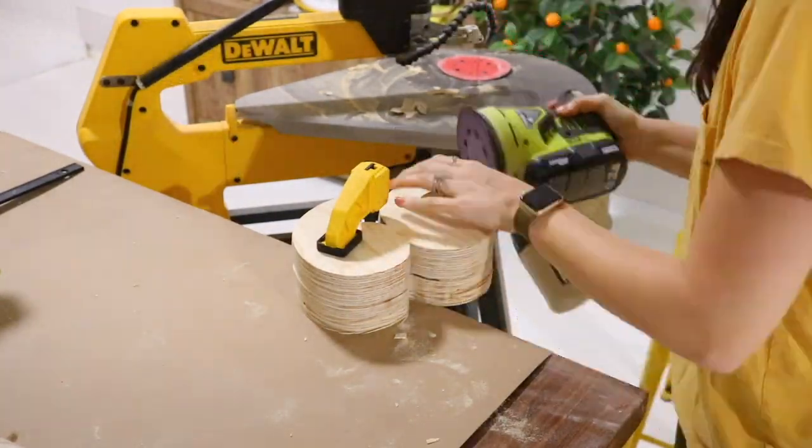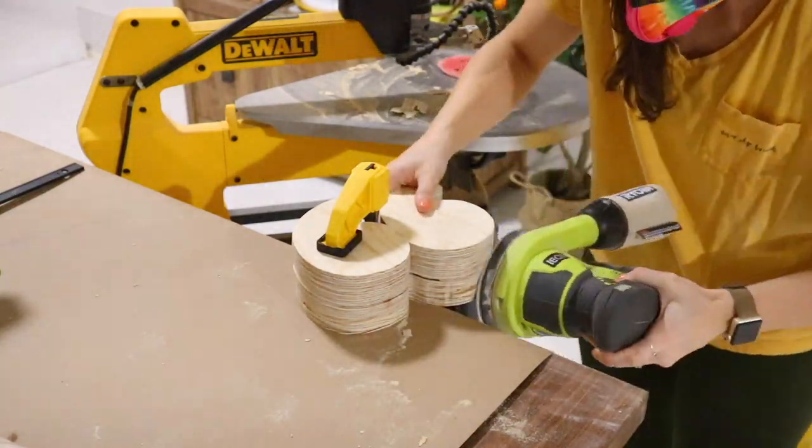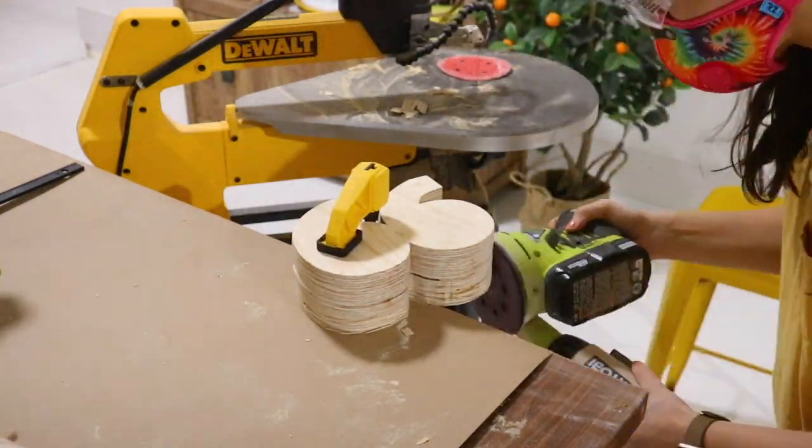Once all the glue was dry I noticed some little areas in the plywood that were missing, so I needed to fill them in. I don't really like working with wood filler from a tub — it flakes easily, the finish is always different, and it doesn't look like wood. Instead I'm using a method where you take a little bit of sawdust from your sander bag, mix it with wood glue, and use that as your wood filler. It dries a little harder and is a perfect match because you're using sawdust from the same wood. Once that was dry I sanded again — 80 grit for shaping and smoothing imperfections, 100 for more smoothing, then 220 for a super smooth finish before painting and sealing.